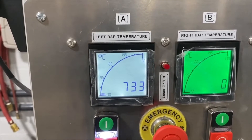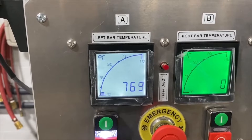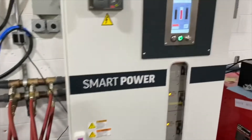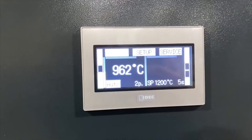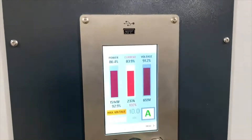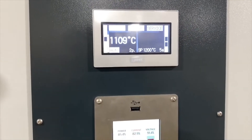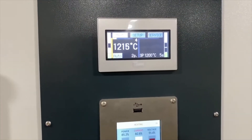Right now you can see the parameter recognizing temperature. The lowest measured temperature is roughly 700 degrees; our set point is 1200 degrees. Once that temperature is registered, the PID controller will kick in and reduce the power output until the temperature reaches 1200 degrees.